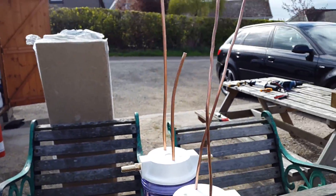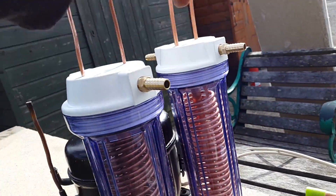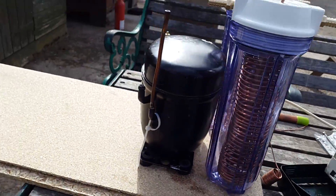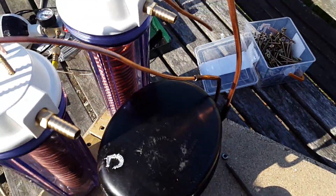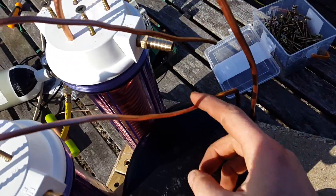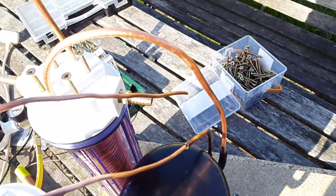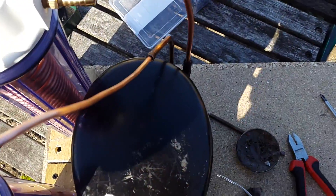Here's where I'm up to — they're both built. Evaporator here, condenser here. It's going to be very compact. Now it's time to begin soldering. I'm just using soft solder because that's all I've got. It does work fine — I've never had any problems — but it's not recommended.